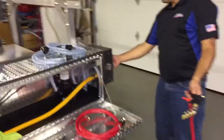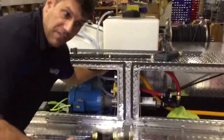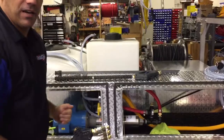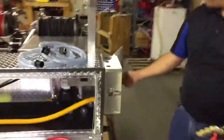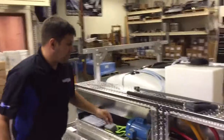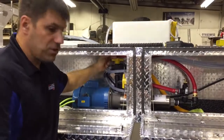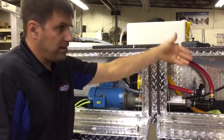We're going to go back over to the proportioner, shut the water off, and do that same process for the detergent. We'll open it up all the way, come over here, turn it back to the garden hose direct feed, squeeze the trigger, force the air out, turn it back to the proportioner, and watch it prime the line for the detergent. You might have to do that once or twice. Once we see the detergent in there, we're going to come back over again, shut the detergent off, and open the SH line all the way. Now we're going to prime the SH line — the same process: come back over, turn it to direct feed from the garden hose, squeeze the trigger, get the little bit of air out of the system, get the pump priming, turn it back, and then watch for it to get primed.